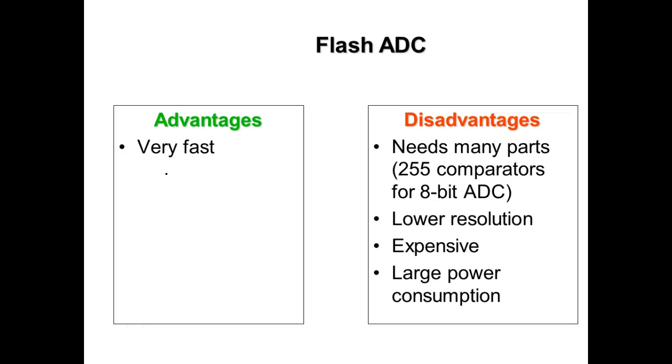Successive approximation is really different. What is successive approximation? Anybody know? So, how can I explain this? What we do on successive approximation is, when I'm comparing these things, let's say this is 100 degrees, and this right here is 0 degrees. Now we've got one option: I can come up here and start my comparator, and I could take samples all the way up this line.